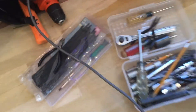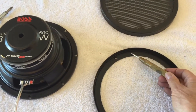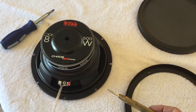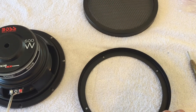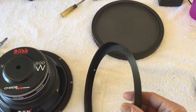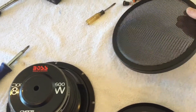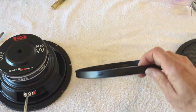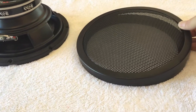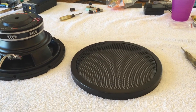What I'm going to do is use the best five bucks you ever spent at Harbor Freight — an automatic center punch. I'm going to mark eight new holes using the speaker as a guide, not even using the four old ones. I'll mark those so they align with the eight holes in the speaker, drill those, and be able to mount the speaker and this ring using the same eight screws. Once the ring is installed, this cover snaps onto the outer radius. We'll get that all screwed together and mount it on the back of the cooler.